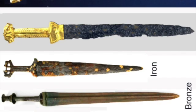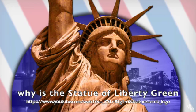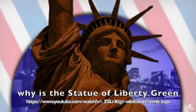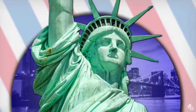Compare this to iron, which is never really satisfied and will rust away completely. So there are many options for altering the color of the copper, brass, nickel, and bronze we work with. In addition to expanding your color and visual texture palette, patinas chemically stabilize the surface of your metal, controlling and slowing the oxidation that would otherwise happen whether you like it or not.